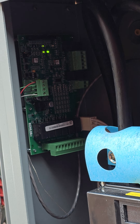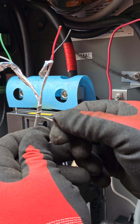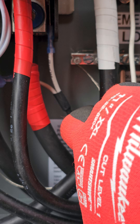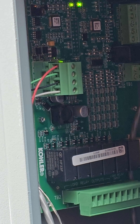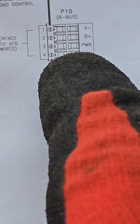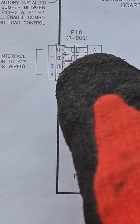You've got your four control wires, and this strand we have connected down here to the ground. On the other side, it's not connected. You can see our four conductors there. If you look on this print that the transfer switch comes with, it shows those four conductors getting landed on A, B, power, and common.